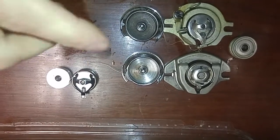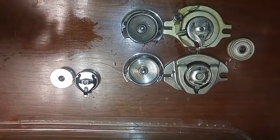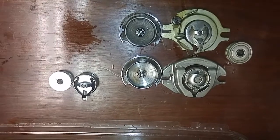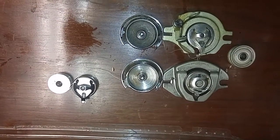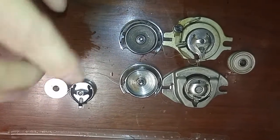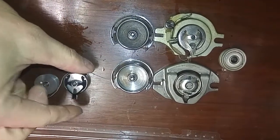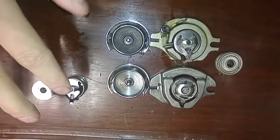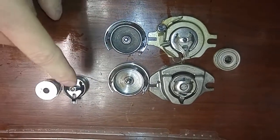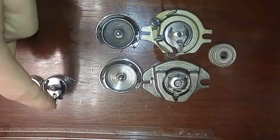For the 120-period machines, whatever the model number is — the aluminum machines that use nylon or plastic parts and oilite bearings, I think they're a sintered steel bearing. The bobbin is definitely different, and the bobbin case, so they're in no way interchangeable. Those may be interchangeable with New Home and Free Westinghouse rotary designs — these bobbins look very similar, though slightly different on the tip.